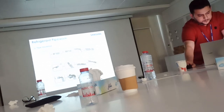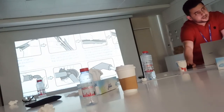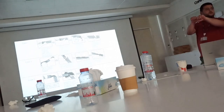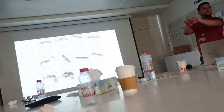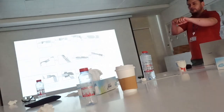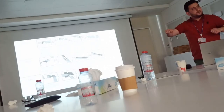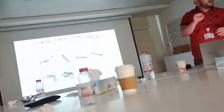Tamam? Another thing, you make sure all the time that fittings are covered with insulation, especially elbows. Okay, especially elbows. And when you do a joint for the insulation, two pieces, one piece 1.8 meter, if you do a joint of this insulation, there should be glue, then bond it together, then wrap with the tape. When you wrap the insulation with the tape, it should not be strongly fixed. It should be just wrapped normally to not decrease the thickness of the insulation.